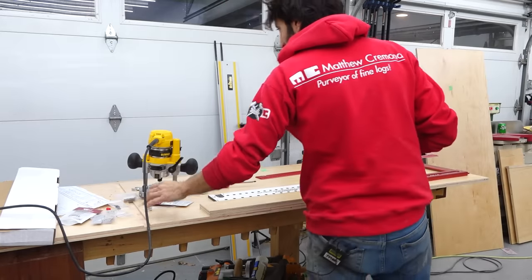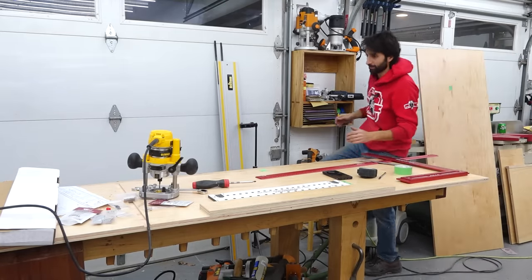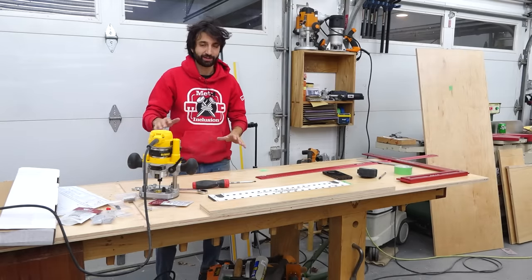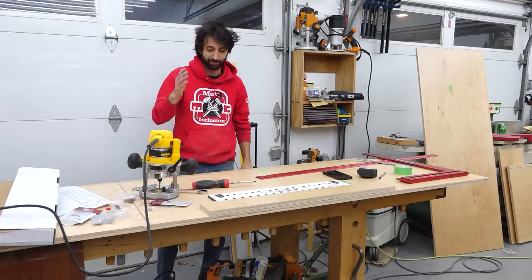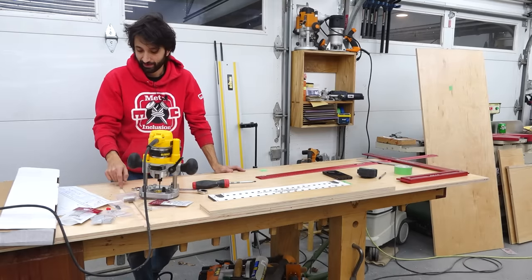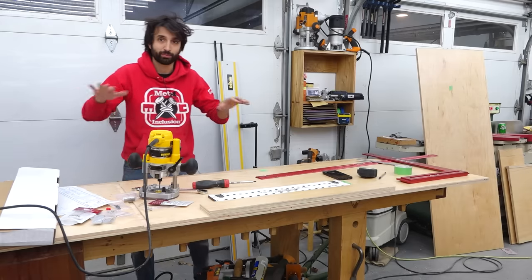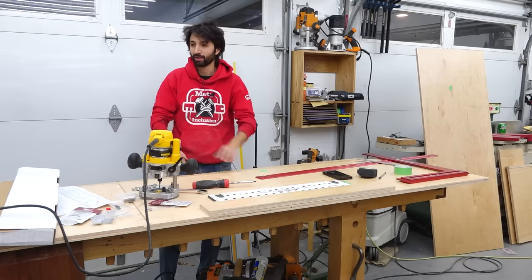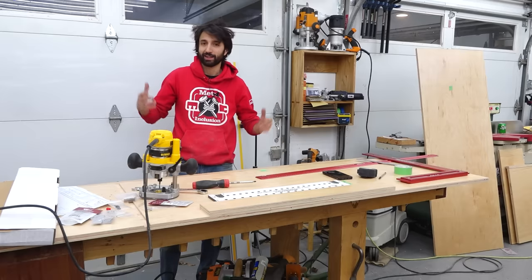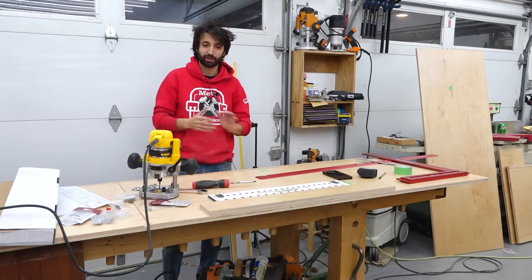Okay, so that dado is for the horizontal divider, since that horizontal divider is gonna carry the pocket door and it's gonna carry the countertop that's gonna be mounted in here. I want an extra bit of shear for this connection, and I'm thinking I'll probably do that for the bottom too, since that's part of what supports this thing going into the floor. We have the face frame and the foot that contacts the floor at the front, and then this thing's mounted to the wall with the back panel, but a little extra support down there, I think it's probably gonna be fine.